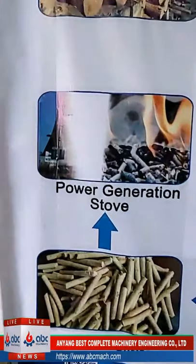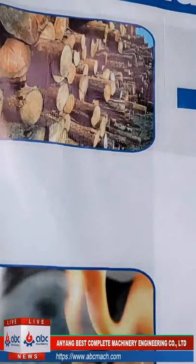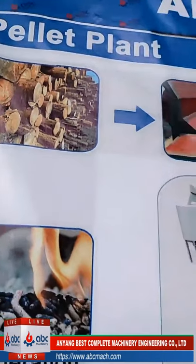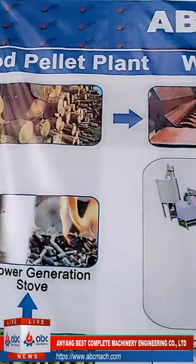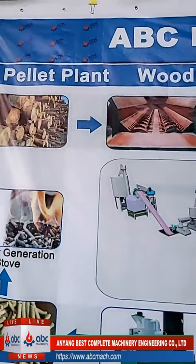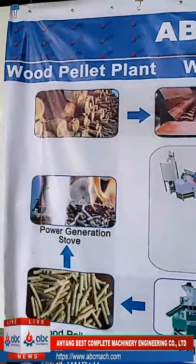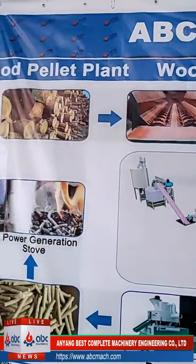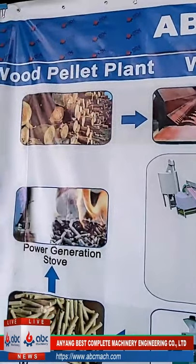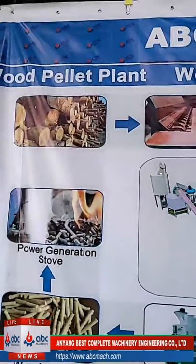Generally the wood logs come with the bark. And when I say bark, it's the dark outside layer, right? Generally when you're producing high quality pellets, there's one standard that is very necessary to control: ash content. Ash content generally means some particles from the raw material cannot burn properly. And for high quality pellets, the ash content normally must be less than 0.3.